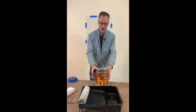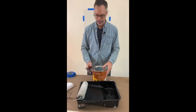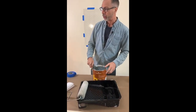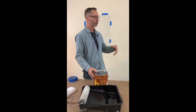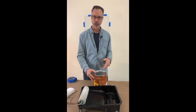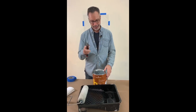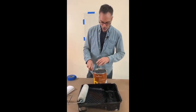We've got some Navajo White. This happens to be Benjamin Moore Ben — we love this paint. It's cheaper than Regal Wall Satin. This is a flat paint, because flat paints do not show your imperfections on the wall. That's probably the biggest benefit, and they can be touched up. So I'm going to open this can.